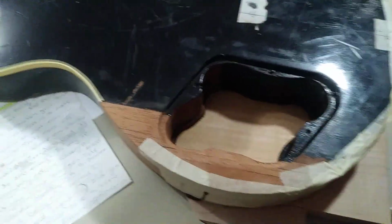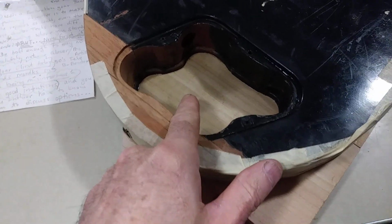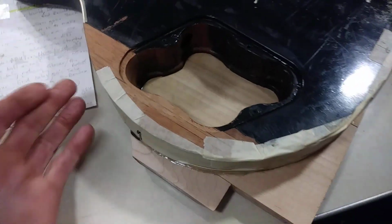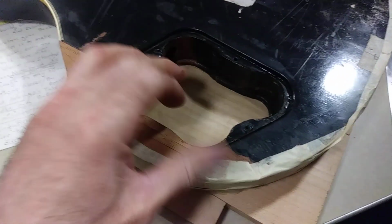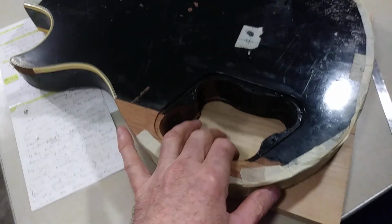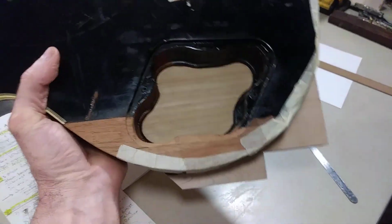You'll have a little corner there. And then after you're finished, take some acetone on a clear paper towel, come in here and wash and clean. Throw the paper towel away and keep washing, keep cleaning all that epoxy off. Why? Because I may want to come in here and stain this. Not with a Minwax, that's not what I'm talking about. I mean with a tint in my lacquer, or take my tint and mix it with a little bit of alcohol and do an alcohol wash where it just kind of ages that maple. So keep cleaning, and don't keep reusing the same towel. Throw that towel away, go to a fresh one, because you want to absorb all of that epoxy. Looks great. Very, very happy with that.